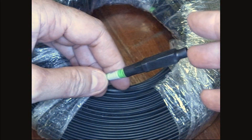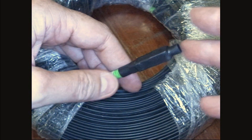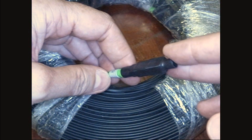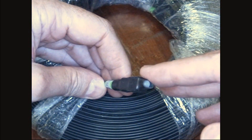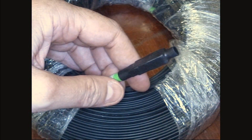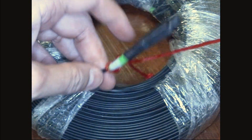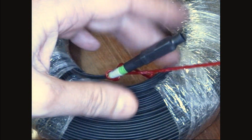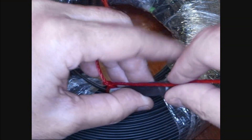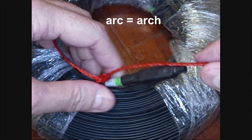I need to pull some fiber optic cable through conduit I've already installed in the house. This stuff is sensitive — it doesn't like to be bent, pulled, or put under a lot of pressure, and it doesn't like to be pulled off center. You can't just take your usual string and pull it on here because it puts too much pressure and stress, it will pull it off to the side. Even if you tape it, you'll end up with a barb and pull it off center — you can see all the pressure will cause it to try to arc. Just not good.